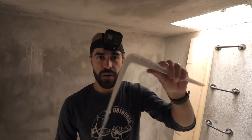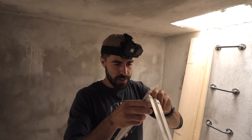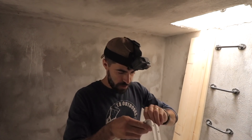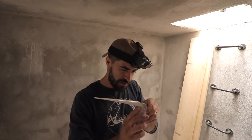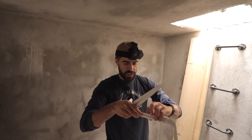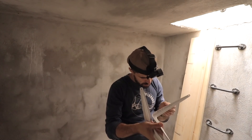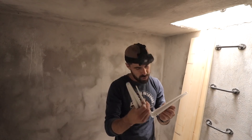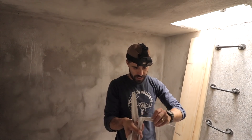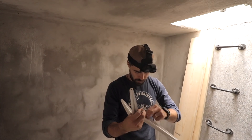I've got myself cheap brackets — these are about £2 brackets from B&Q, which is just a hardware store, a very orange hardware store here in the UK. I'm going to go for two brackets on each shelf because I'm not putting a ton of load on it. They can take 20 kilos, and I'm not going to be putting 20 kilos worth of gear on there. Anything heavy will be stored on the floor.